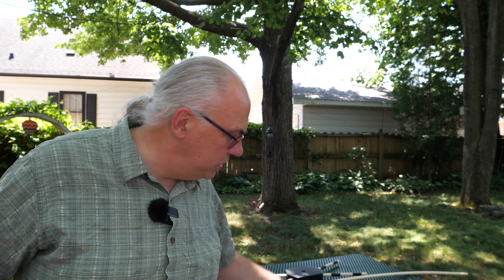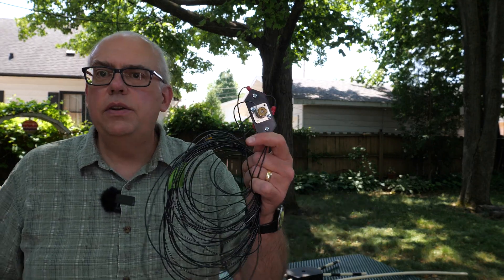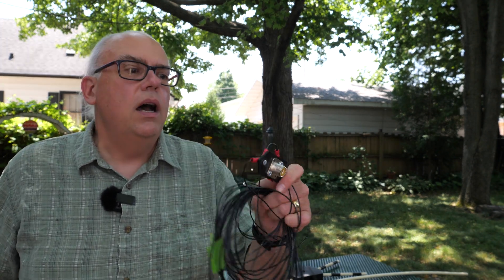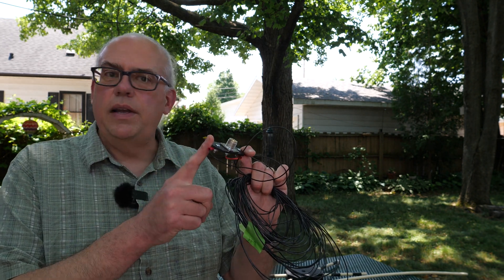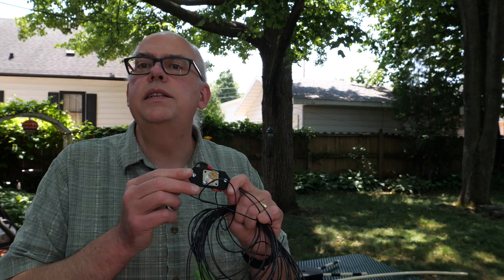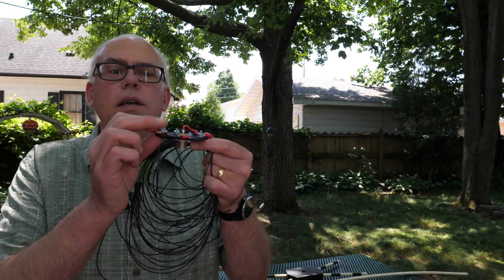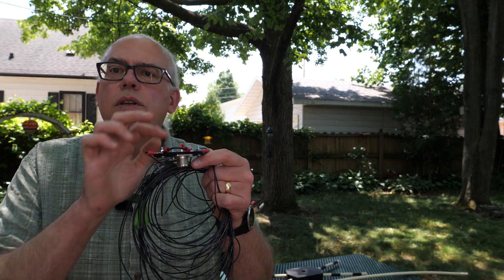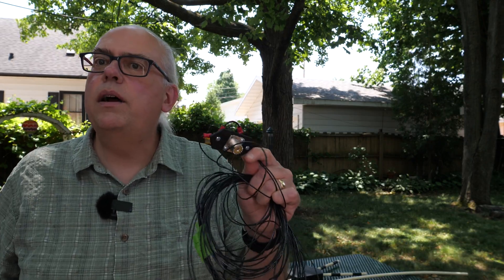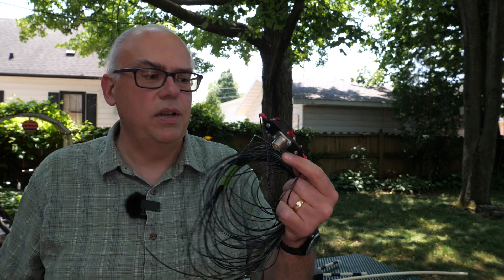I think it's going to make a really big difference in the overall structural integrity of the antenna. Thanks a lot, Chuck, for those two tips — they are greatly appreciated. I also had a question about the weight of the center connector. I 3D printed a center connector and added an SO-239 connector to it. This weighs 33 grams, which is very lightweight. The next lightest connector probably on the market weighs 38 grams, so this is a little bit lighter than that. I was surprised at how lightweight this is, considering I was using No. 6 machine screws for the mounting hardware. I could probably trim this down even a little bit more and get a couple more grams off if I can lose a couple of these screws.